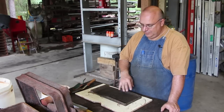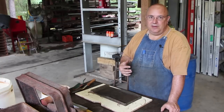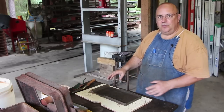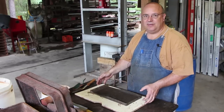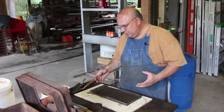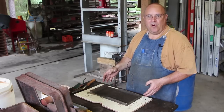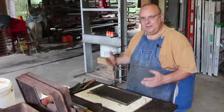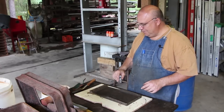I found a person who has this piece on their lathe, and they were gracious enough to send it to me to use as a pattern to cast a new piece. Now the original part is made out of cast iron, and we could send this off to a foundry and have it made out of cast iron, but I don't have the capability of melting cast iron myself. And because this really isn't a super critical part — it's just a cover plate — we're just going to make it out of aluminum. That will be fine for the application at hand.